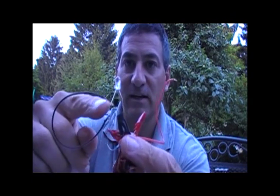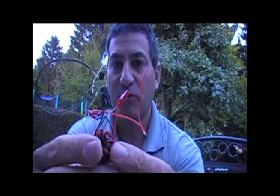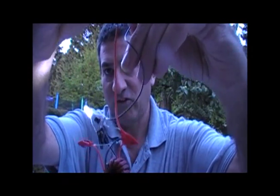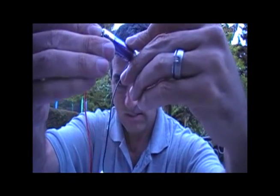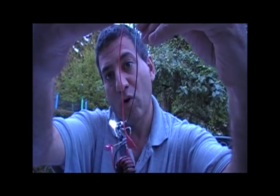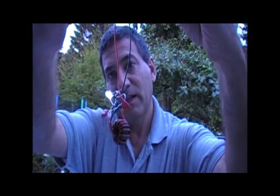So with a single battery, we get nothing. But if I take that same battery and the same LED and mount it on top of this joule thief — which is this torus wired to a 1-kilohm resistor and an NPN transistor — then you will see, when I attach it, there it goes. Now I'm using a single battery to light the same LED.